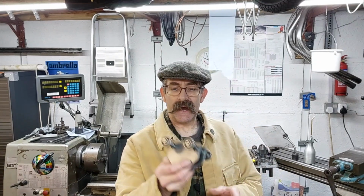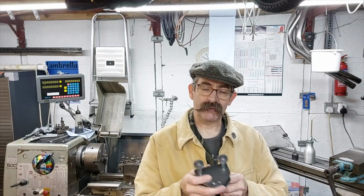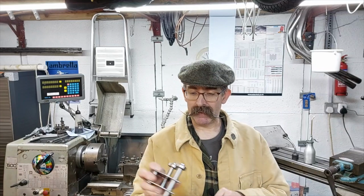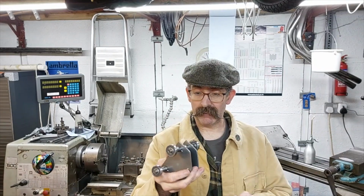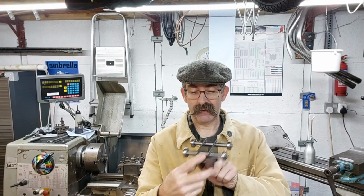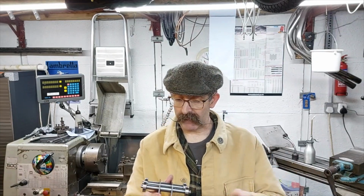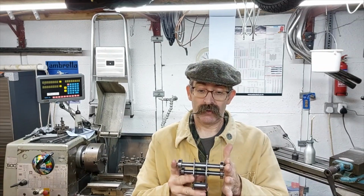So I needed a carriage, and this is the carriage I made. I'd bought the bearings earlier on. I had a little inkling I was going to do something like this. These were 10 millimeter internal bearings, just little cheap sealed roller bearings. The plan was to bolt these originally into some sort of assembly that I could hang the chain hoist on the bottom of. So yeah, had the bearings, but then decided it would be better if they were mounted on shafts.